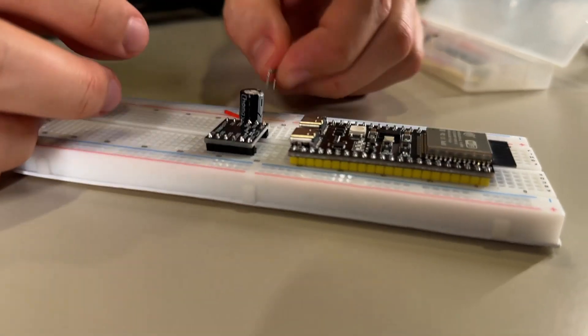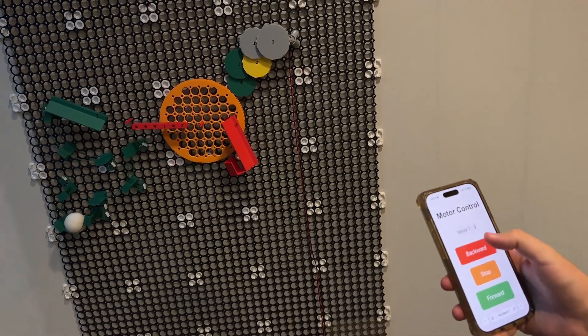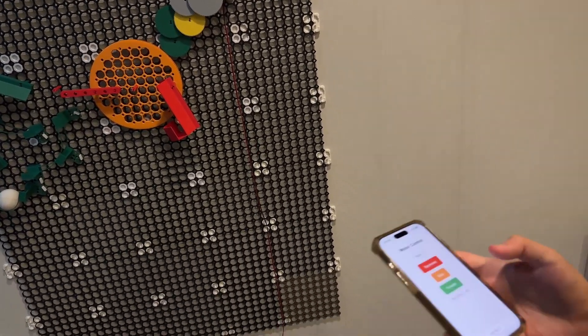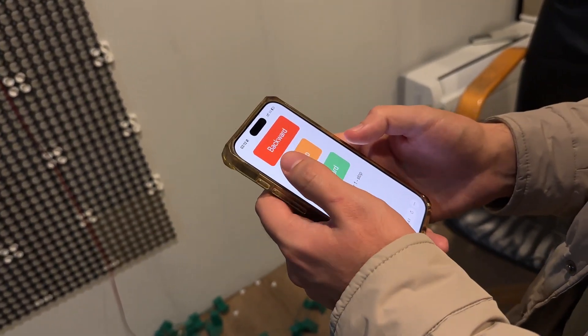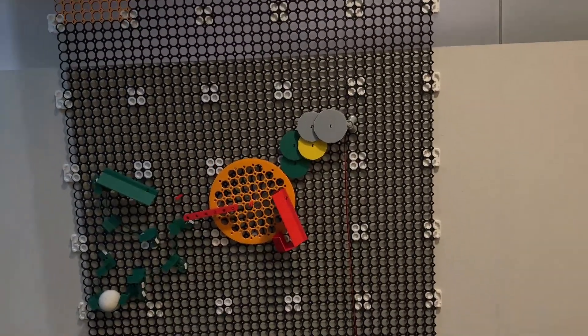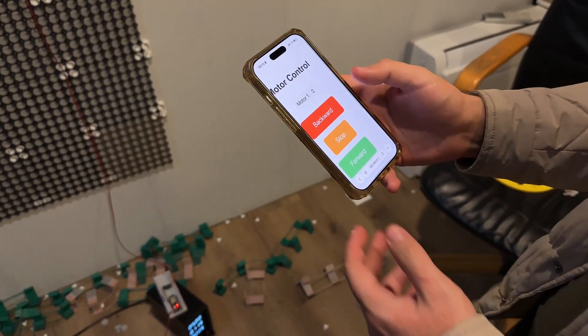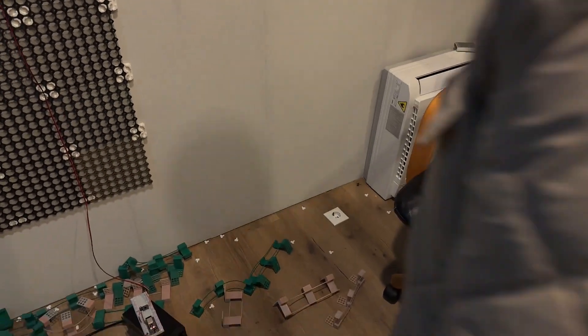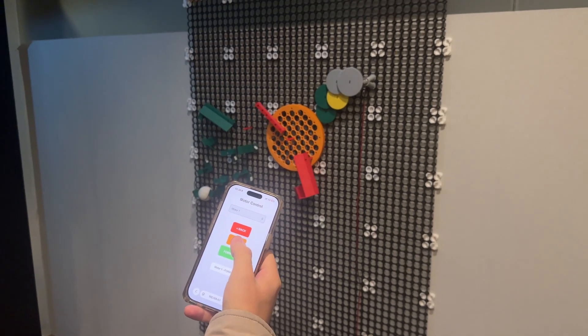Connected the ESP32 with the driver. With Claude's help, I made a website to control one motor. And another problem — I've already lost count on those. Motor turns on, controller shuts off, cycle repeats. Reason: microcontroller and motor on the same power line. When the motor starts, voltage drops, controller reboots. The microcontroller literally shooting itself in the foot by turning on the motor. No time for a proper fix, of course. Separate power for motors and controller. Done.